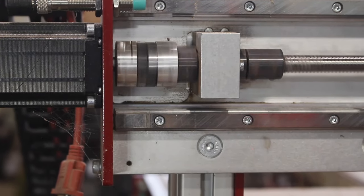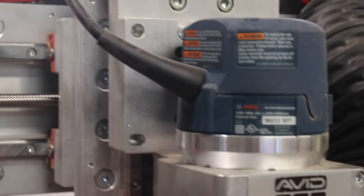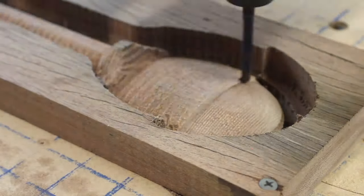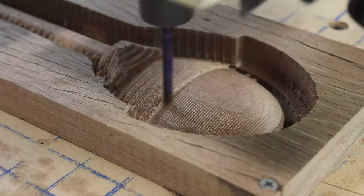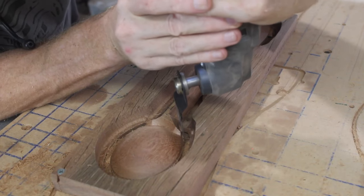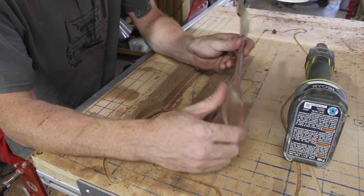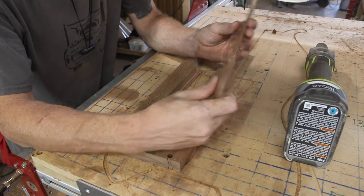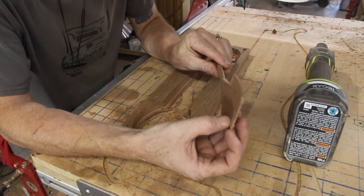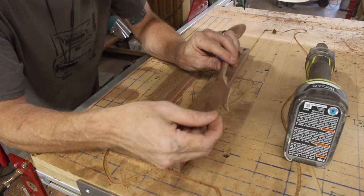As I started roughing out the back side before even getting to the finishing pass, I started noticing some problems. The quarter-inch tabs I had put in were in good locations for me but not for the tool. Where I'm doing the most carving for the longest time — where it gets the thinnest — is up where the spoon head and spatula head are, and they were not supported. So my cuts were not that clean because things were chattering. This is the first time I've cut it since I modified the file, and I think it's just a bit too thin in the tip — I need to edit the file to make it a little thicker.